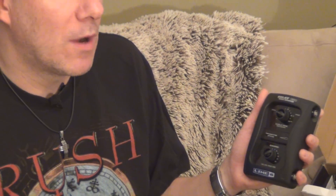Some people might say, why do you need channels if there's no interference? Well, basically there is no interference — the channels are there for when you need more than one unit. So if your bass player needs a unit and your guitar player needs a unit, you put everybody on different frequencies. You put your receiver on channel one and your transmitter on channel one so they can communicate with each other.